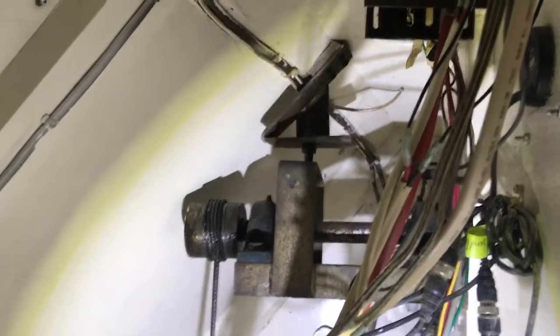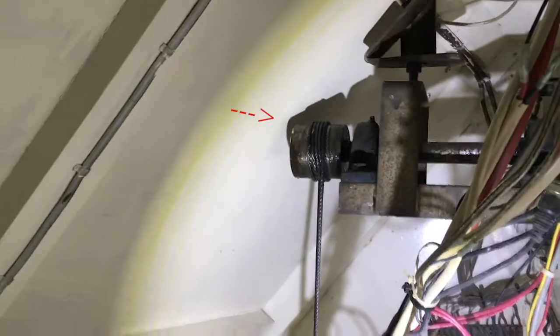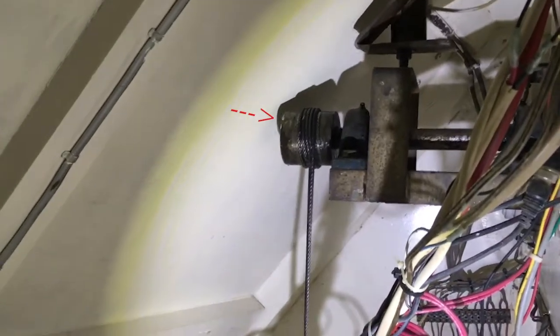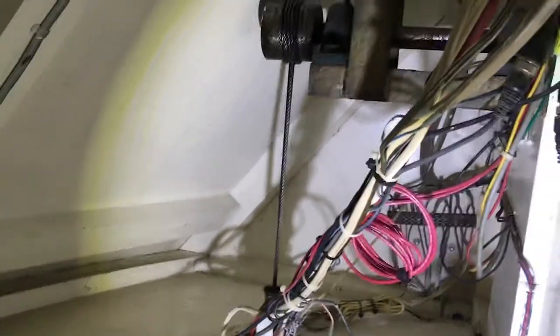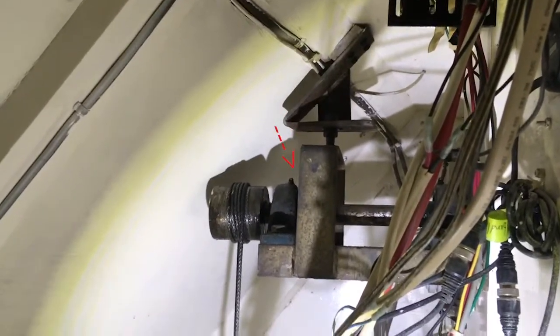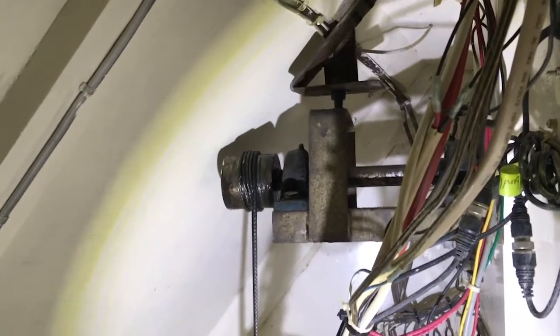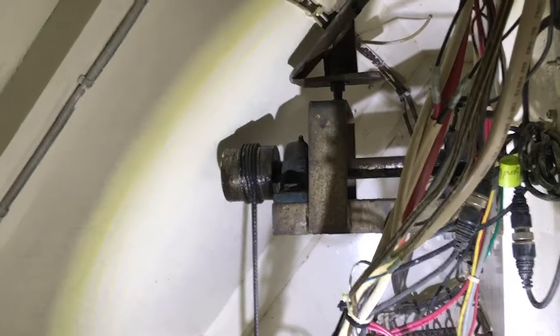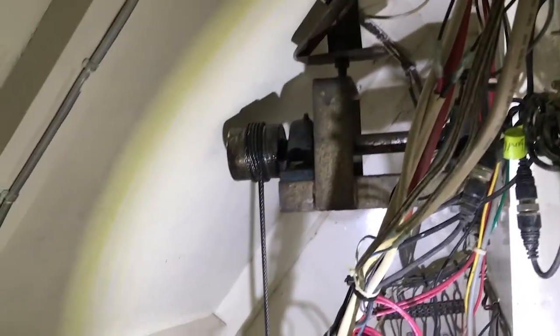Okay, we're now up in the dash of our fly bridge, and that round thing with the cables on it is what is actuated when you turn the steering wheel, and then those cables go down below where they connect to cables from the salon. So there's also a Zerk fitting up here, a grease fitting, that we're going to shoot some grease into, which will help lubricate things also. So we're going to crawl into the dash here and lubricate these.